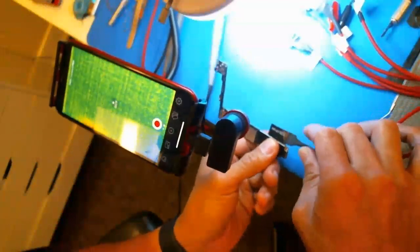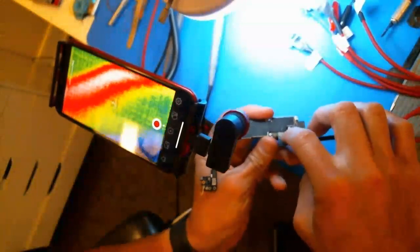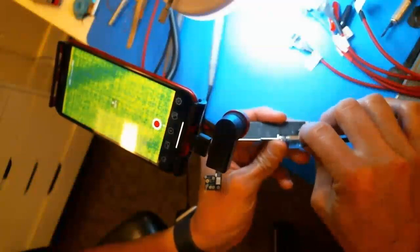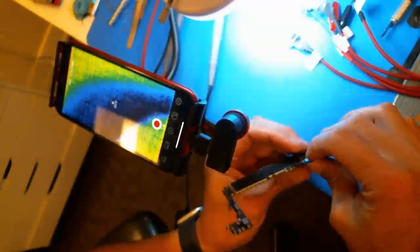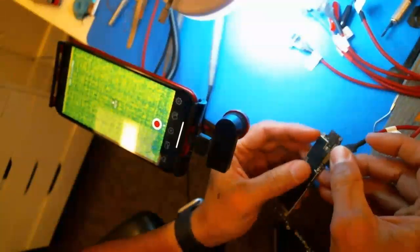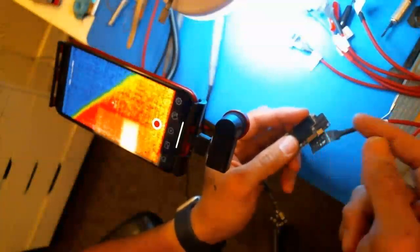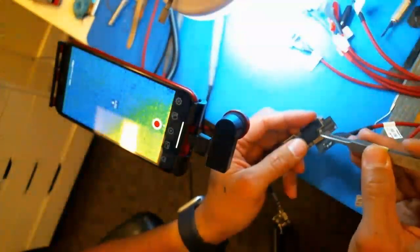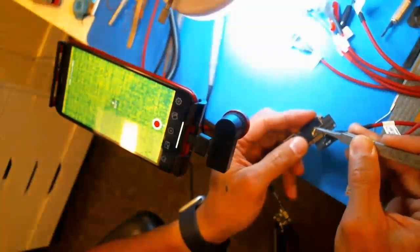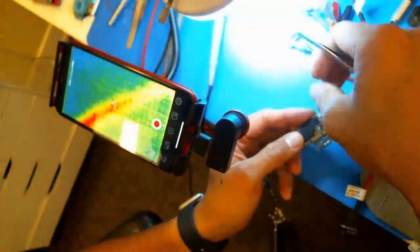I plugged in my iPower — which connects to my DC power supply with a charge port and battery connector — mine's a little loose so I have to hold it a bit. One thing about the iPhone 8 and 8 Plus: this little flap right here is metal, and if you push down on it there's a cap below it. Sometimes you push it and it'll zap and smoke. It's just a poor design — this flap is metal and there's a cap right there, so sometimes you're pushing down on it and it'll short out.